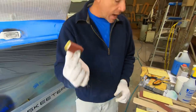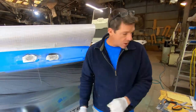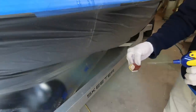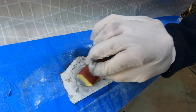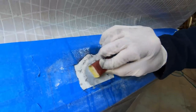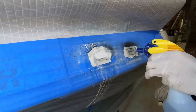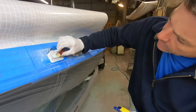A wood block is very hard and very rigid — it's not going to flex or move. On something like this you want to really stay focused. We've got a handy zip water bottle — that's water with just one or two drops of Dawn in it. I'll hit that with a little water and stay really nice and tight on the area that we filled. I'm trying not to get out on the surrounding gel coat at all. I'll change directions back and forth. You can see the guide coat is really highlighting the areas that need a little more attention.